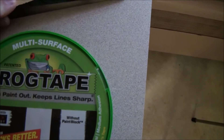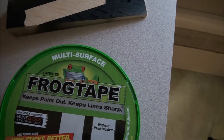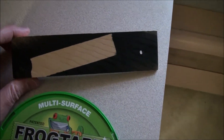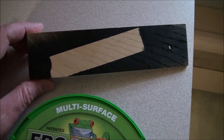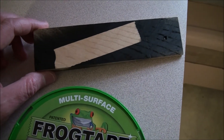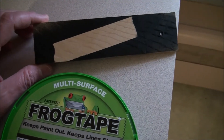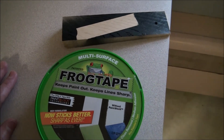This was an unfinished piece of wood — fairly smooth, but not sanded to a high polish. I put the frog tape on quickly, did a quick spray paint pass, then immediately peeled the tape off, and it had bled. So frog tape didn't work so great for me.